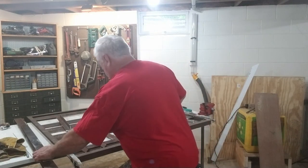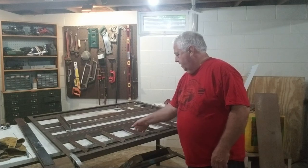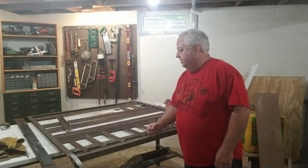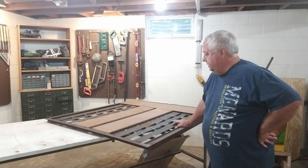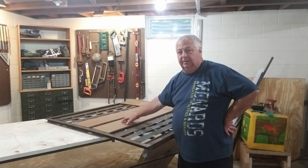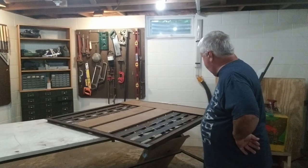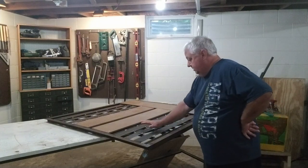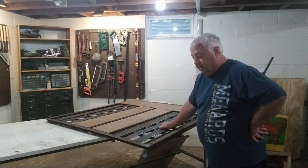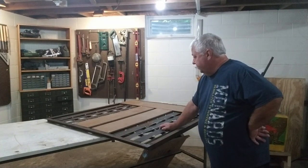Right now I'm cutting all these pieces at 45 degrees so I can weld them in there real nice. There will be two main tracks where you drive equipment up, and then the center part will be for a dolly or cart — I'm putting some pieces there too to make a track. It should let the air through and won't be a sail. Here it is all welded up. I added some of these pieces of plastic — this is a ramp for a dolly cart, and it'll also help hold in dirt like a tailgate. The ramps turned out pretty good. The steel was really rusty — if you've ever welded rusty steel, it blows up your weld when you hit a pocket of rust — but there's plenty of weld on here so it ain't going anywhere.